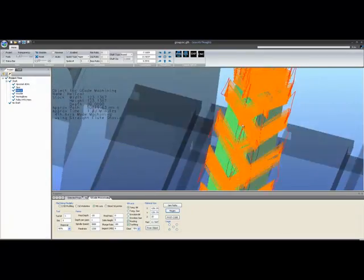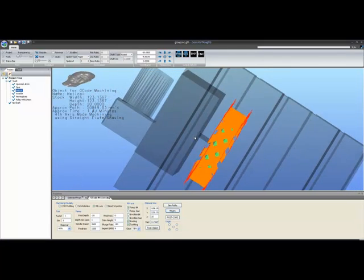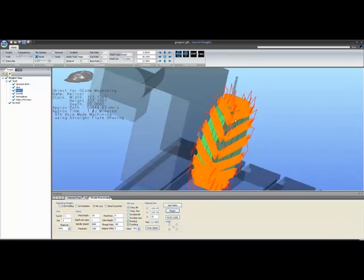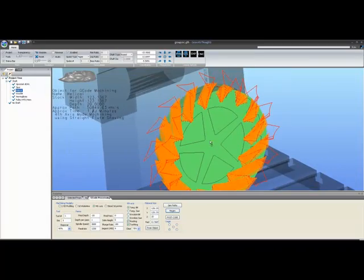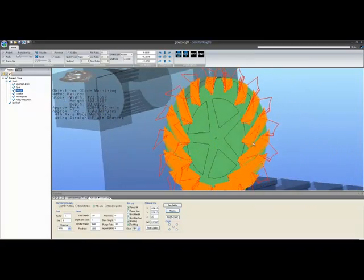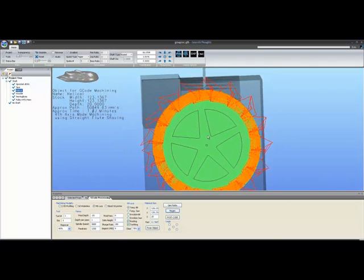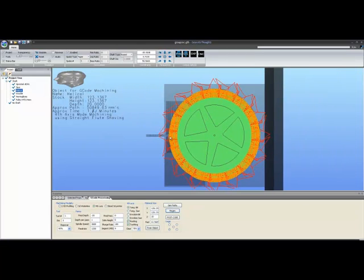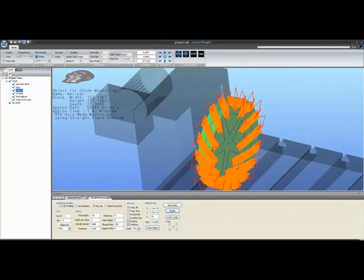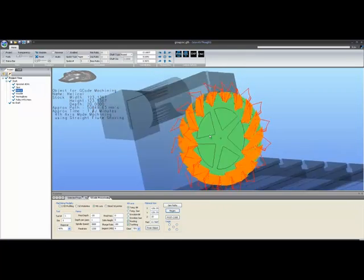This gives you room in case your gear is wobbling back and forth a little bit because you're not 100% centered. This could stop you from scraping the side of the gear. Hopefully you don't have any wobble, but if you did, this might help you. You're going to find that you don't have to be 100% dead accurate when you're cutting a gear. It's amazing the actual tolerances that are built into the system. But when you find, as in the video, that you're machining something and the tool is coming way over to the left and it's missing the blank entirely, that probably means that your setup is wrong.